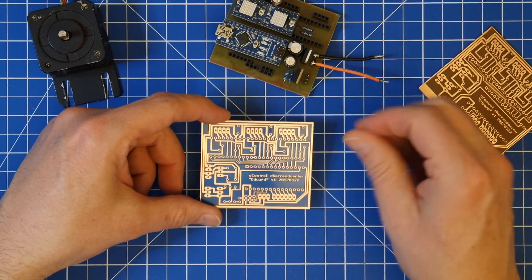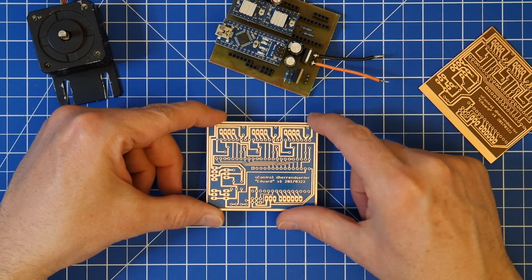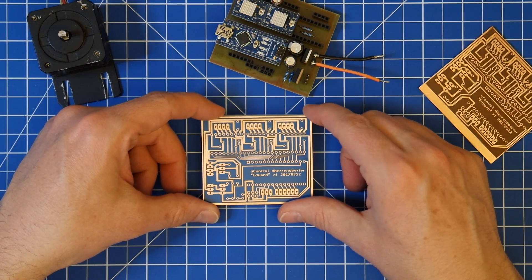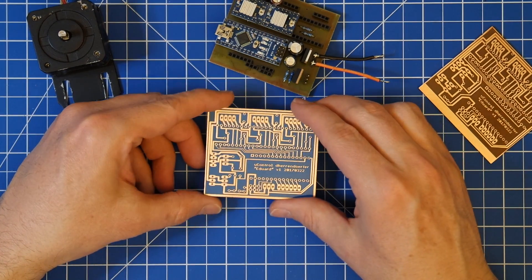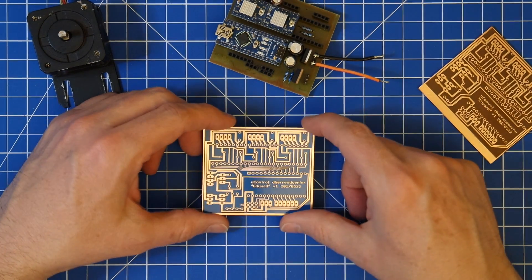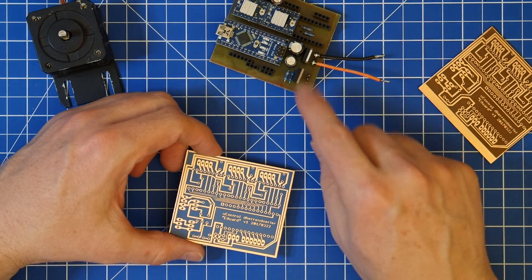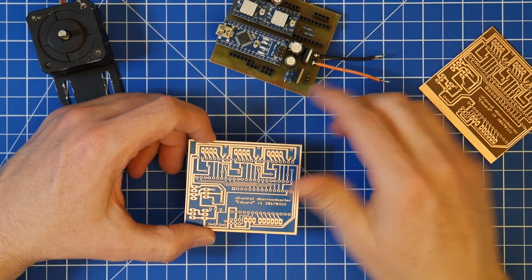It was so nice and easy to do. And as you can see, I spent a lot of time making the traces wider, so you can have a better power supply. I rearranged some of the capacitors so we've got better smoothing and noise reduction. I also added a LED that will light up when the laser is powered, and it is no longer the LED on the Arduino board, because it's better to have this one on the Arduino board tell you about the status of the controller, and a second LED on the controller board telling you what the status of the laser, LED, motor, or whatever is.